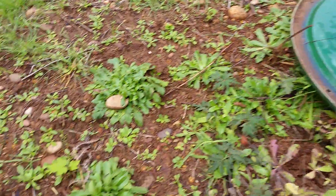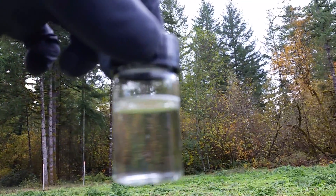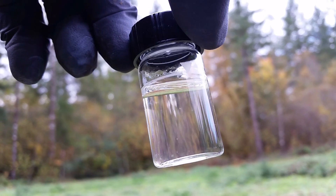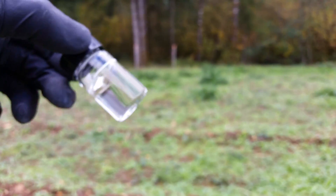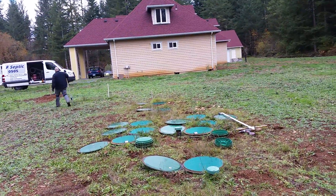Our final result is the water being turned to the drain field is clear water — there we go. Now we don't have a disinfection unit in this — no Salcor, no disinfector, no chlorination or anything like that — so there could still be a pathogen in this water. But that is the water now being discharged into our drain field, which is all out here. We've got inspection ports and stuff, so that's what we look forward to on taking care of a new water system on a lodge.